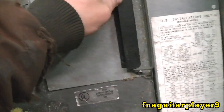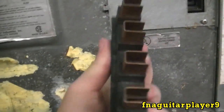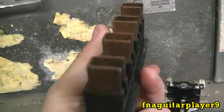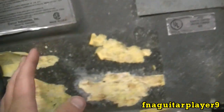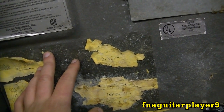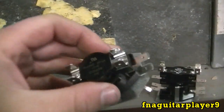The first thing you want to do is turn your breaker off, then pull this out - this is your main disconnect in the furnace. There are several different designs on these but these are the U-shaped ones. When you pull that out it disconnects all your wiring in here. If you can't get to the breaker just pull that out and you should be safe, but I recommend shutting the breaker off just to be on the safe side.